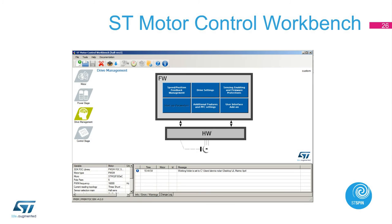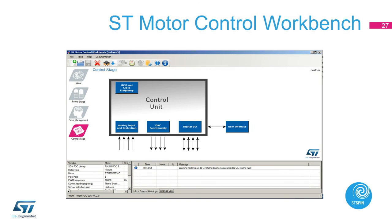In the drive management window, it is important to enable overvoltage, undervoltage, and overtemperature features. In this window, we can change the PWM frequency and PID parameters for torque and flux regulators. The last option is the control stage, where we can select the STM32 subfamily device and the CPU clock frequency, nominal MCU supply voltage, DAC functionality, GPIO mapping, timer and pin mapping, timer and pin mapping for the sensor interface, serial communication configuration, TXRX pin mapping, and start-stop button GPIO mapping.